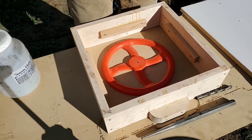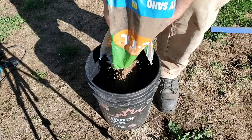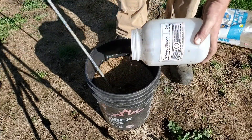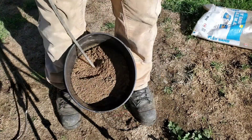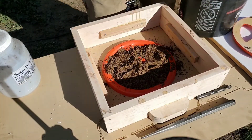Today we're going to be casting a hand wheel for my arbor press in the side shop. We're going to use play sand bought at the local hardware store mixed with sodium silicate — roughly about a cup. Later on you're going to see it's a pretty rough casting; I should have used a finer mesh of sand.